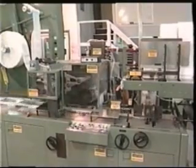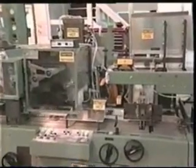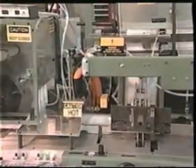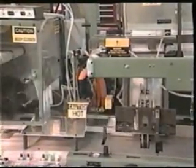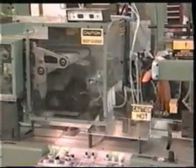As we see the machine here, we are running a pouch-type pad material using the registered cut option of the machine, that makes sure that the knife cut between the pouches and the pad is exactly centered between the pouches.